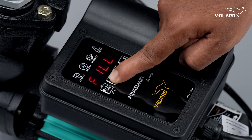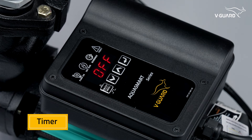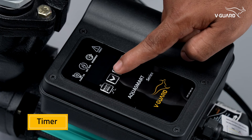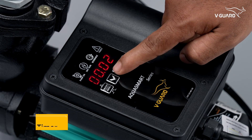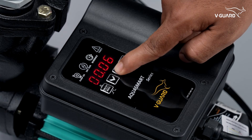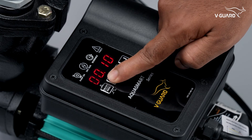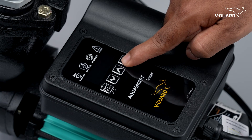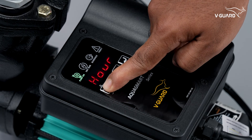Now look at the TIMR timer pump application. The timer mode is an additional way to operate the pump for a desired period of time regardless of the water level. It overrides the normal and scheduled auto modes. When the main supply is on, the pump will run for the set duration. To fill the tank, you need to turn on the power supply to the pump each time.